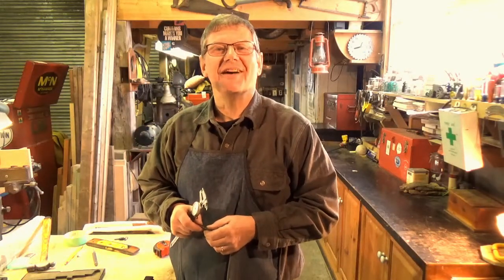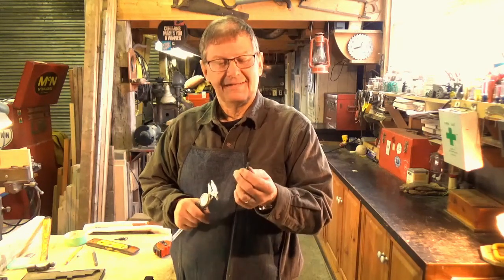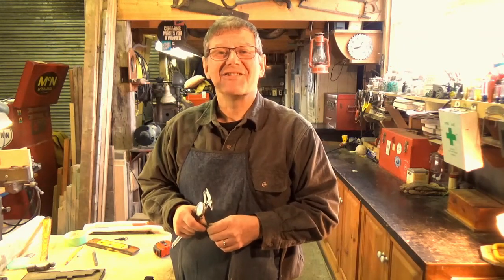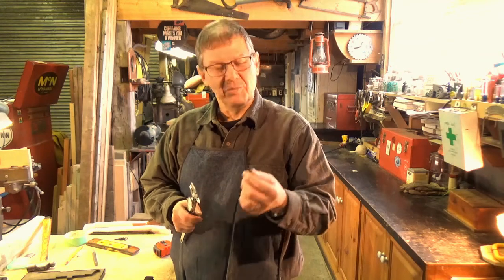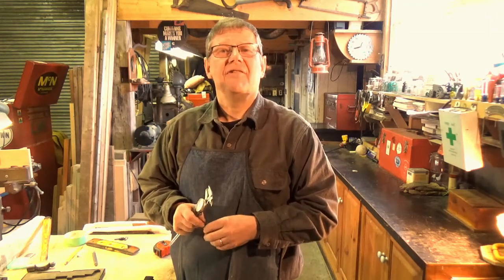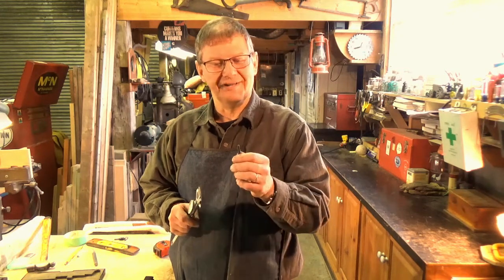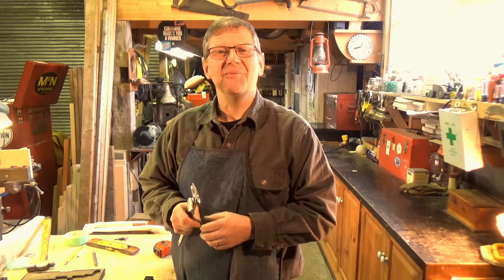It's important we make the diameter of this pilot cutter the right size. If it cuts too large a pilot hole, the threads will just be loose in the stock. And if we make it too tight, when that screw goes in it'll put a lot of pressure on the stock and may even crack it. Let me tell you a story. When I was a boy, I saved up my money and went to Canadian Tire and bought a set of swivels — just flat-headed slot-type wood screws. My father told me I should drill pilot holes, but being a teenager, nobody's smarter than a 16-year-old. I went downstairs, put the gun in the vise, used the soft jaws, laid it all out with a center punch — and didn't drill a pilot hole. I drilled the screw in tight, tight, tight and broke a piece off the heel of the stock. I glued it back on and my father helped me after that. Talk about a valuable lesson — it was a rich learning opportunity.